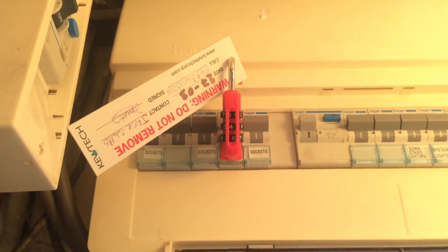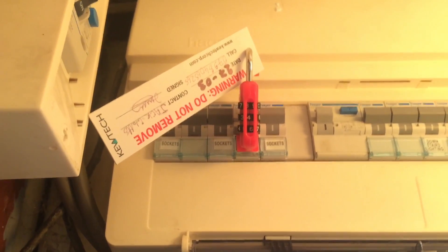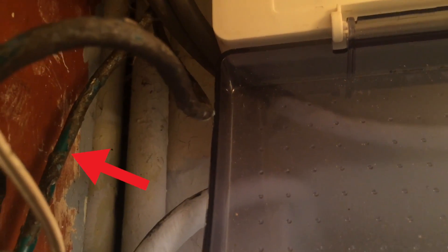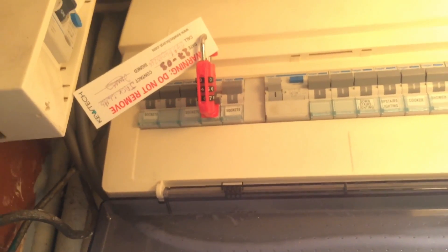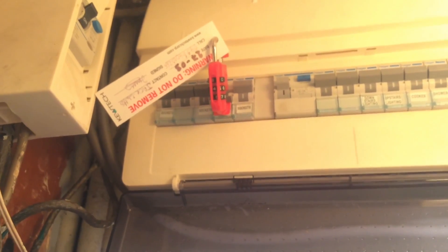That 30 milliamp protection is for the socket outlet circuits. Jack's outside light comes from a fuse connection unit off the socket outlets. The earthing conductor comes out here and goes outside to an earth electrode, and Jack will be upgrading the bonding while he's with me as well — whether we get that on video today or not, I'll be coming back to see the upgraded bonding.